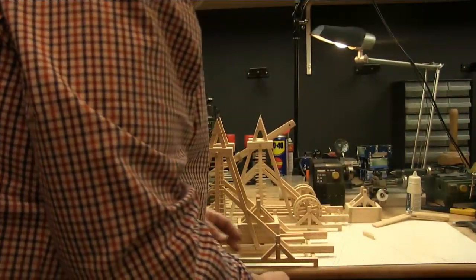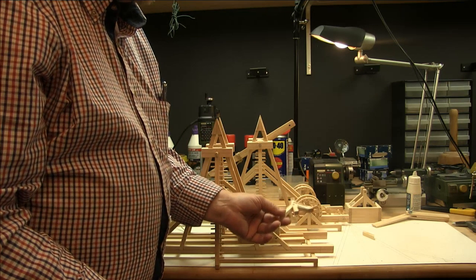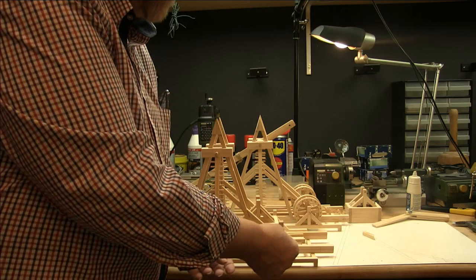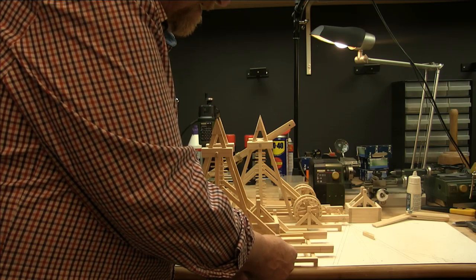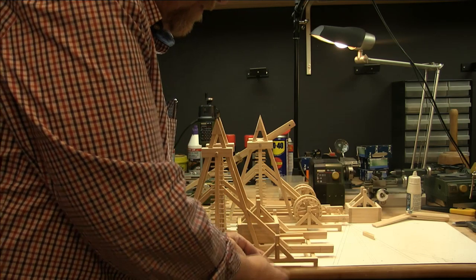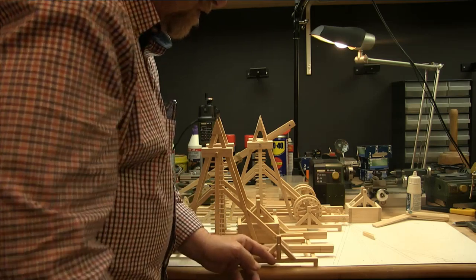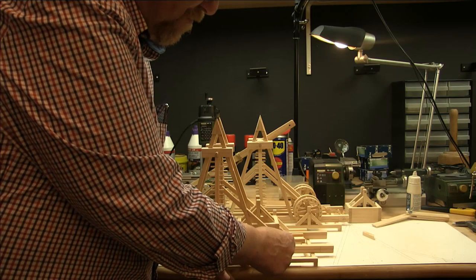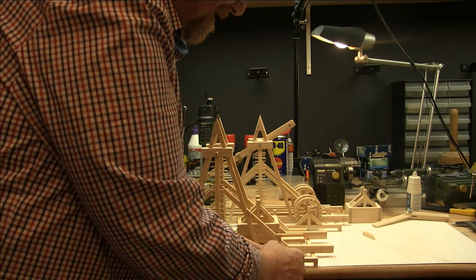And where is my, it is here. See, first I drill. The reason I have not put these on yet is that I first drilled the hole in them, and then I use this 5mm stick to decide where to make the hole in this one, so I'm sure that it all fits right. Because if you glue this one on first, then you have to be very precise, and there is not much room for failure here, so you need to make it precise,